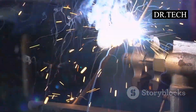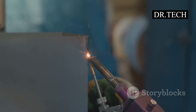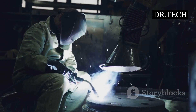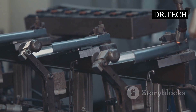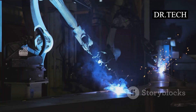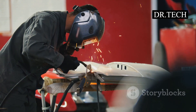Another big plus is that it's pretty clean compared to other welding methods. There's not a lot of smoke, and there are no filler materials like welding rods to add — the weld is made just from the metal sheets themselves. This means less mess and the area around the weld doesn't get super hot, since the heat is very focused. So the metal pieces don't warp or bend as much — a big deal when parts need to fit together perfectly. Spot welding is also great for automation: robots can make hundreds of thousands of spot welds exactly the same way, consistently, without getting tired.